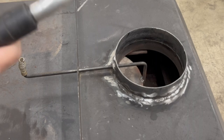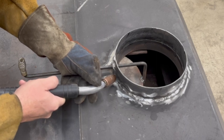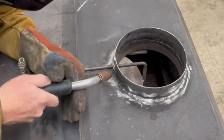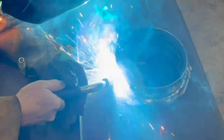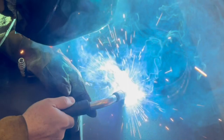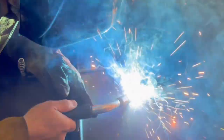We've got it cleaned up again and here we are. We're going to show you a technique. I'm kind of doing a little backwards C as we move from left to right. This is in real time so it'll show you the proper technique and speed for actually doing it. So watch that nozzle — I'm kind of making a little backwards C going up and down, covering the old weld but also filling it in and making a nice looking row of stacked dimes.